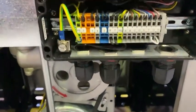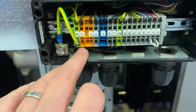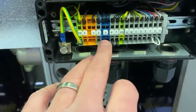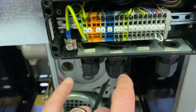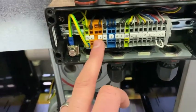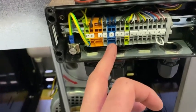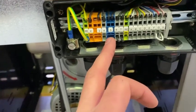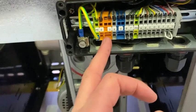Looking inside the electrical junction box in the Petrotec P1000 commercial pump, we've got live, neutral, and earth. Bring your 230 volt mains in: live into the left-hand side of terminal three, neutral into the right-hand side of terminal five.